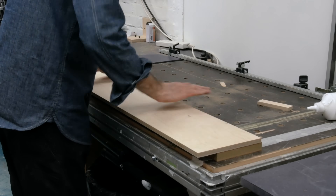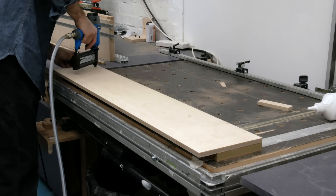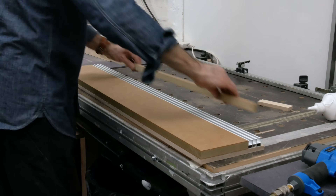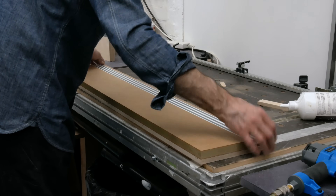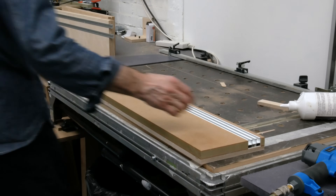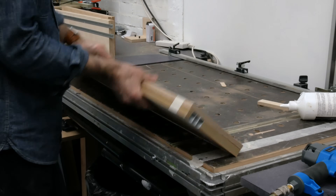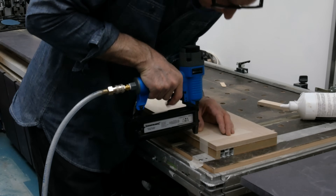The back face of the bench is made with a 12mm birch ply backing board with a 22mm MR-MDF fascia cut to allow the IKEA curtain track extrusion to be fitted flush with the surface. I've used 22mm MR-MDF simply because I had some and didn't want to buy a full sheet of 22mm birch just for a couple of short lengths — plus the back faces a wall, so aesthetics aren't a concern. The curtain track is set 12mm down from the top edge so that the rail hinge bears against the fascia nice and plumb. The front and rear extrusions on my bench will never be connected, so I've made no attempt to match their heights.